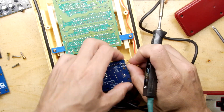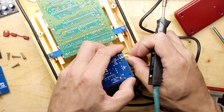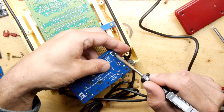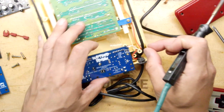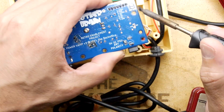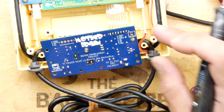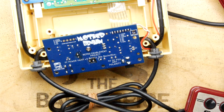So imagine you've got them in from Japan and you're just testing them — you don't need good composite filtering, you just want any output to see if they're dead or alive. I use those boards for that, and if it's dead I just leave them in the unit. Now I'm unsoldering the power switch, just putting pressure on it and pulling the wires out once it's heated — and there you go, they just pop straight out. I'm going to try the solder sucker approach for the remaining pins.